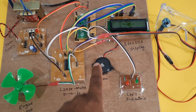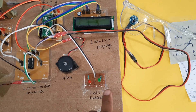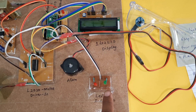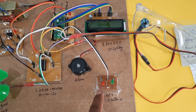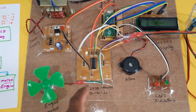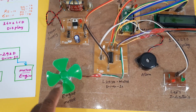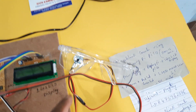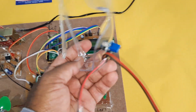There is one alarm, one red LED, and one green LED indicator to show whether the driver's eye is closed or not. If it is okay, the green LED lights up; if there is a fault, the red LED lights up. We are controlling the motor with PWM technique using an L293D motor driver IC, a DC motor, and an eye blink sensor module.